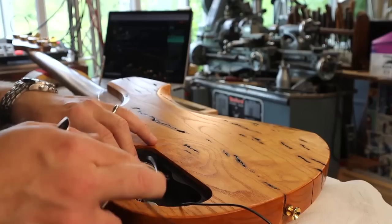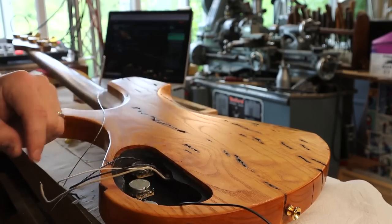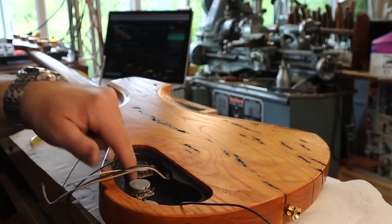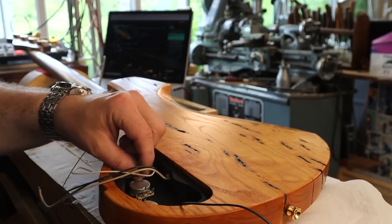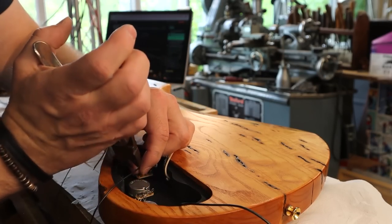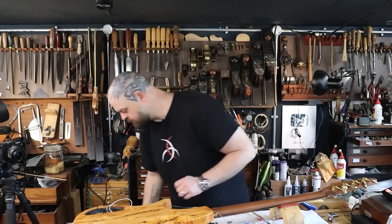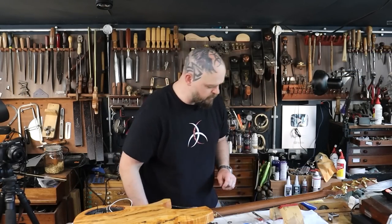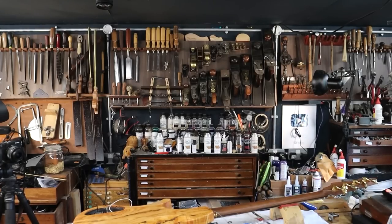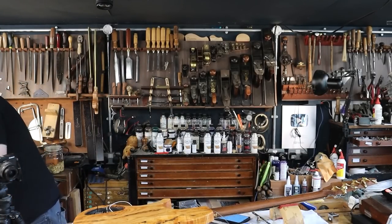Wire trimmer. You tend to want to have the earth wire star off one point so you don't end up with a ground loop, so I'm going to do that on the central one. For now, let's chop my ground. No! I plugged in my soldering iron, and it turns out the extension lead wasn't plugged in. That sucks. We're going to need to sort out the back plate as well once wiring's done.